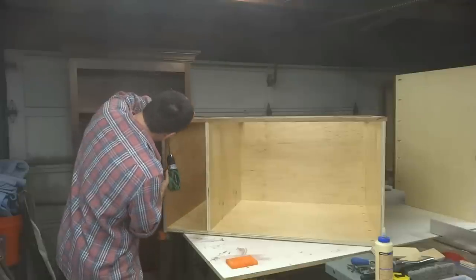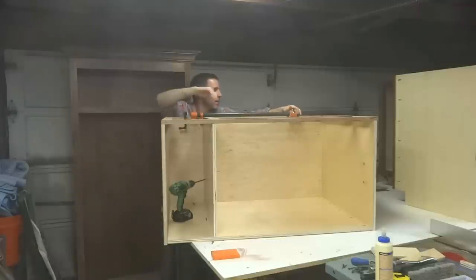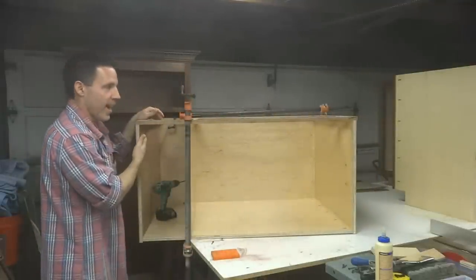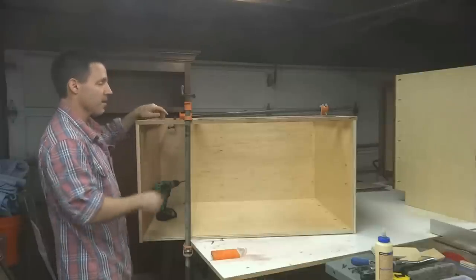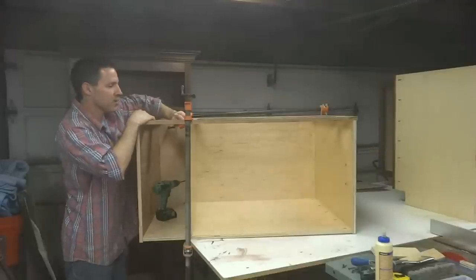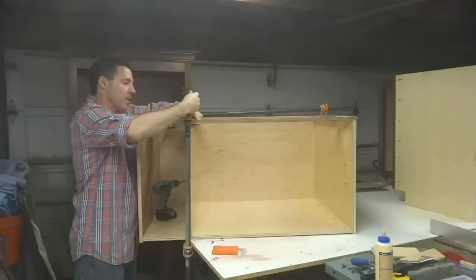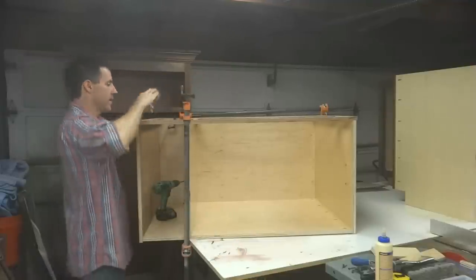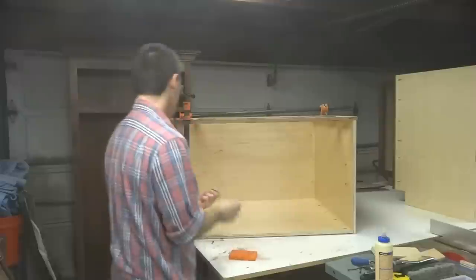Sorry for the back of my head in the way, but it's tough to get at it. Now that I've got the right side of the cabinet anchored in, everything is flush and the glue is wiped out. I can go ahead and start the center panel — just clamping pressure to keep this flush with the side panel, because that's going to be the one I'm mounting the drawer slide on. I just want to make sure it's flush with slight clamping pressure. Using the fine thread screws, I'll go ahead and anchor this side.